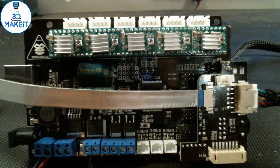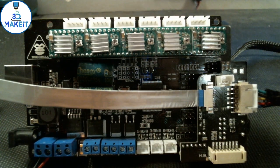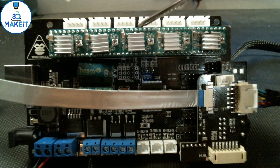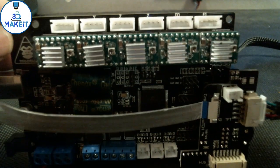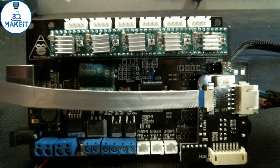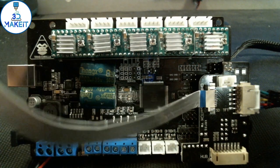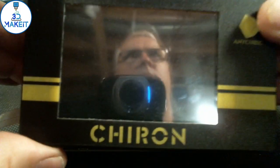So this is a tri-gorilla board. We've got our X, Y, Z, and an extra Z if you weren't running the Z stepper off E1. Then we have E0 and E1. This is a very versatile board. It's a good solid 8-bit board — we've got an SD card reader built in and a screen.